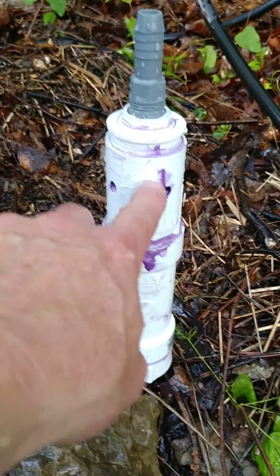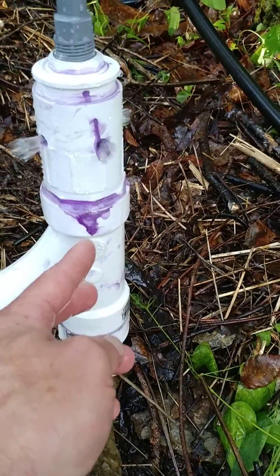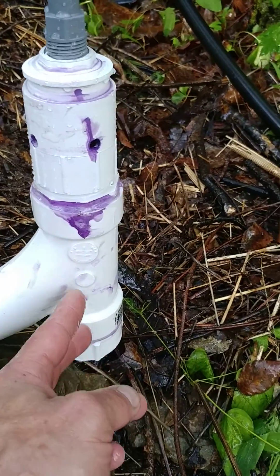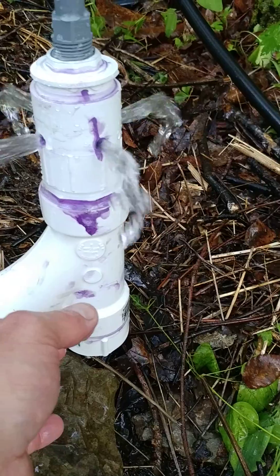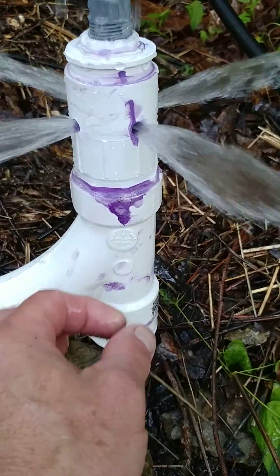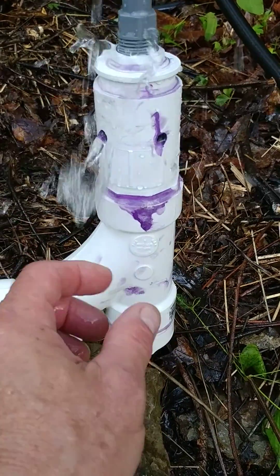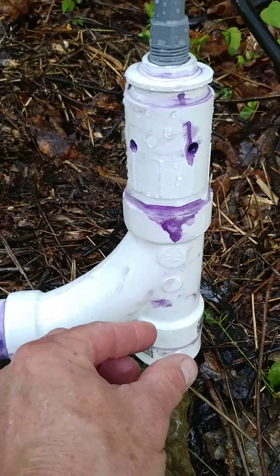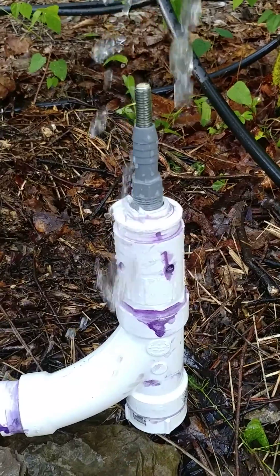The three-eighths has rubber grommets — two sets, one up top where it hits and claps, and two of them together. I just squeeze them together with one and a half inch washers and some lock nuts, and basically it just keeps it centered up so it just goes up and down, and that's what you get.